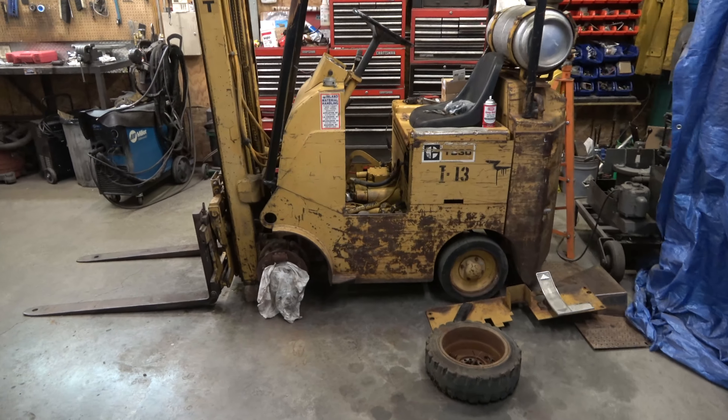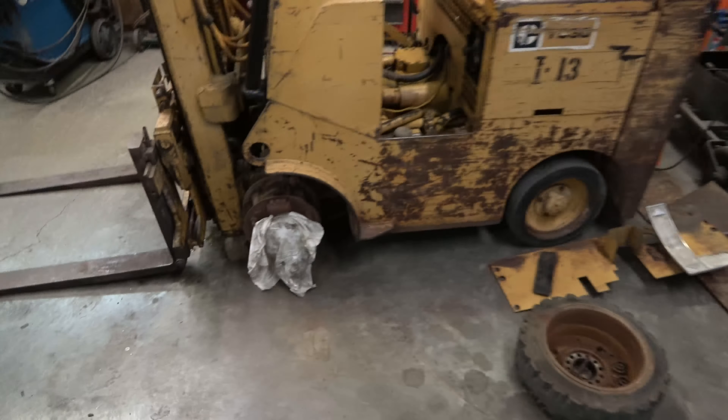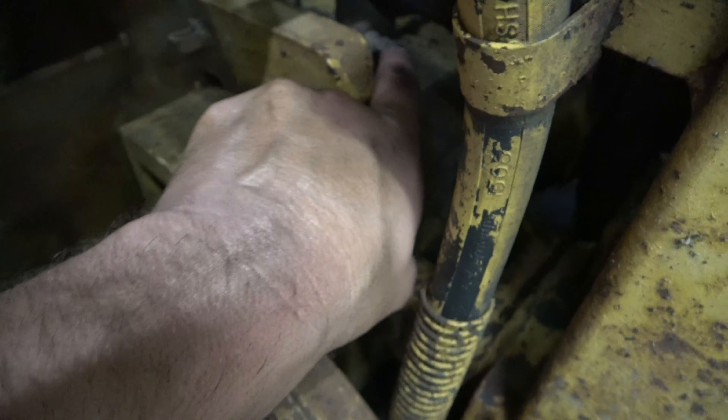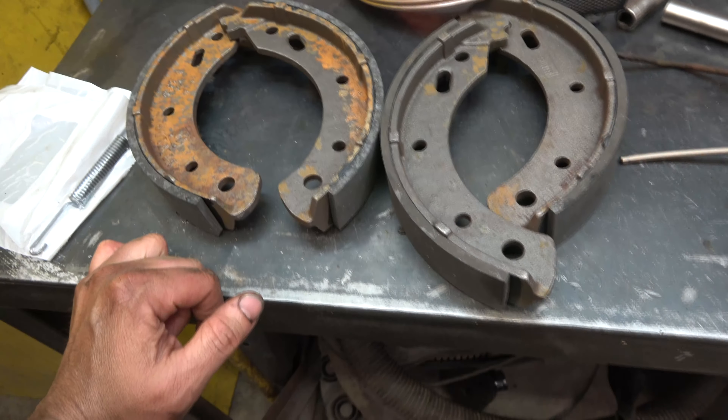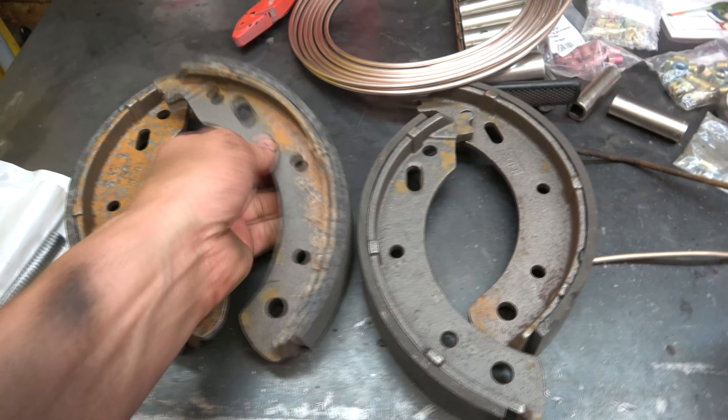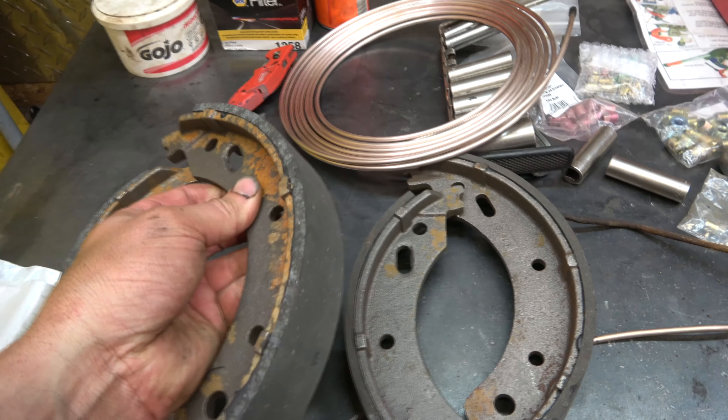Back on the forklift — I don't even know how many weeks it's been. I made a decision on these brake lines. They were pretty beat up right around the fittings, so I'm just going to change them out. I already got this side done with some NICOP lines. Both the left and right side go to a common bleeding point in front, so both bleeders are right here. I had the original brake shoes reshoed — cost me $50. Online, each individual shoe is like $75 a piece.